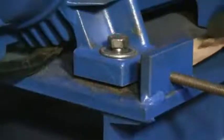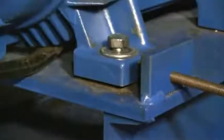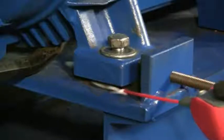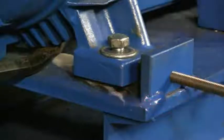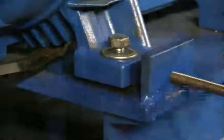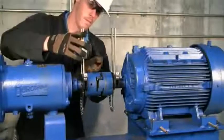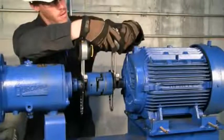Clean and prepare the area under and around the feet. We want to make sure we don't leave anything behind that can get under the feet and cause distortion of any kind. This means loosening all of the hold down bolts and cleaning out any dirt, grease, rust, or scale. By doing this, you'll have good metal-to-metal contact, and you won't give the foot anything to compress on when you tighten the bolts. Now you can start your rough alignment — the point is to get it eyeball clean, so don't spend too much time on it.